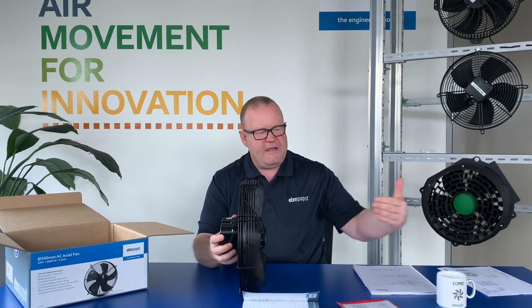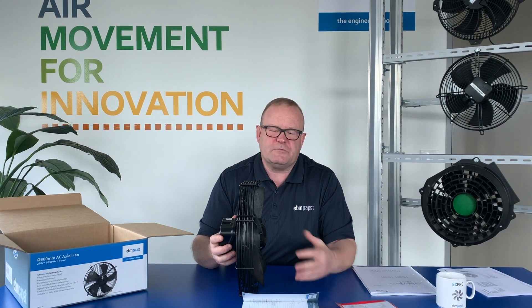This is an axial fan, so air flows through the product in this direction. Axial fans are typically used inside evaporators because we want broad air coverage, and also the static pressures inside the evaporator are normally quite low, so axial fans can be used in that application.